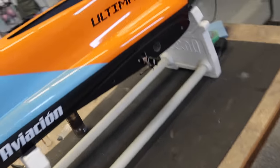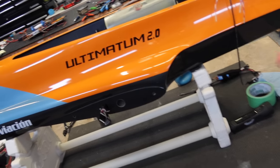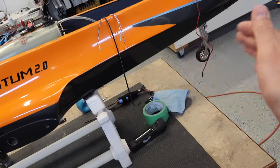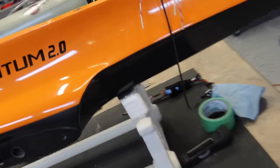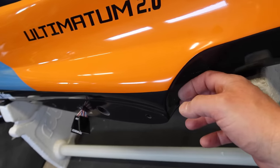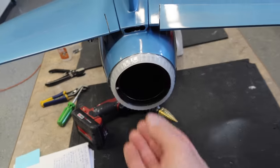So obviously if you're cooking along, especially on this aircraft, you're gonna have all the gear doors, well, the front one really is the only one that matters. The front one's gonna be closed, sealed up, so the air is gonna be coming in the inlets. The faster you go, the more air is gonna be forced in, so most of that air is gonna be coming out of the pipe.